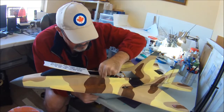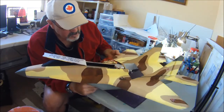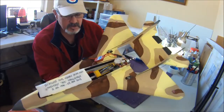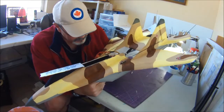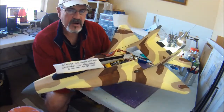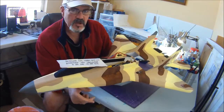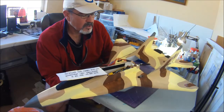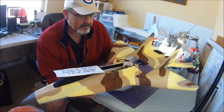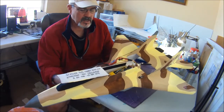And I've been finding that the plane flies better. This was sort of inspired when Dave Powers did that battery booster seat video. I now try and put my battery right on the dead center line. That sometimes requires a few clicks of trim in the roll, but I'm fine with that because I find the plane flies much more balanced, especially if you're getting slow.